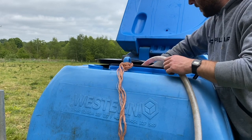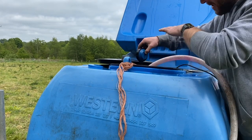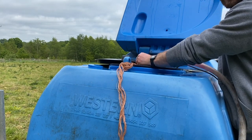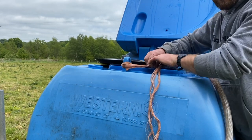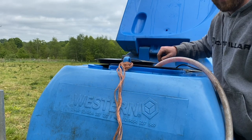All I'm doing here is tying this float switch up with a rope. As I'm pumping and the tank goes low, once the float folds flat the pump would switch off — so I tie it up so that I can pump right down to the bottom of the tank and she's not going to cut off.